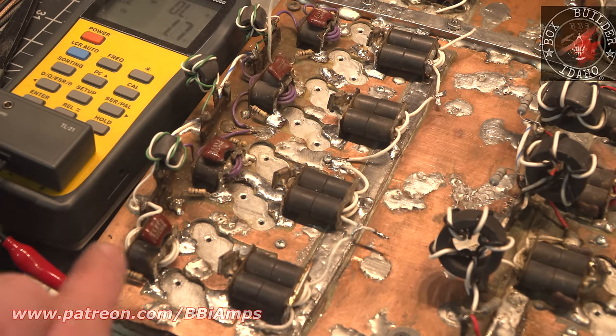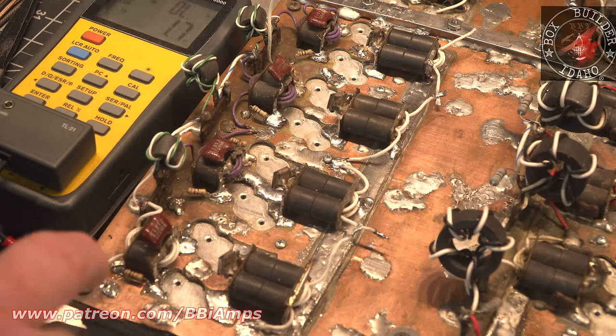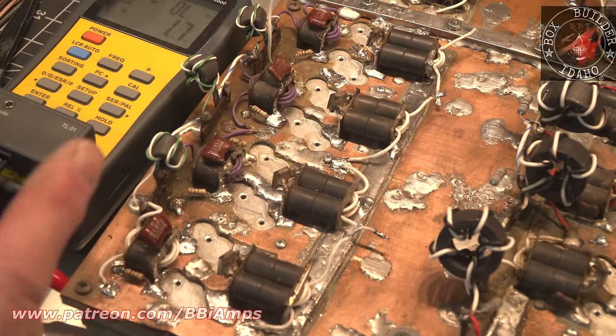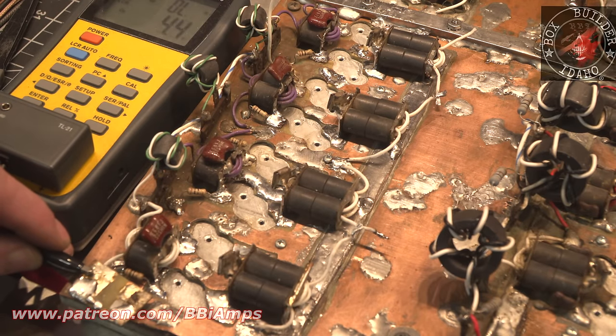That means that this one transformer has been a bane for some technician out there over the last few years, and they've changed it out so many times that they messed up the wire, and then they messed up the traces, and what it boiled down to is one, not enough airflow getting through the box, and two, if you can remember back a couple segments, the transistors were not able to sit flat. So this thing literally got run to the ground because the guy that was working on the box didn't know what he was looking for. This was not a repair. This caused more problems than you guys will ever even understand.